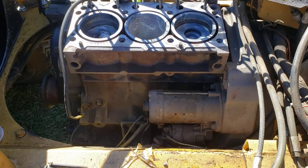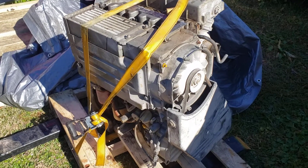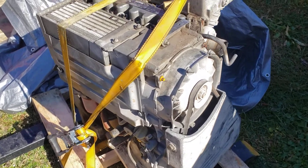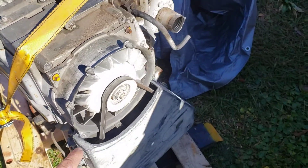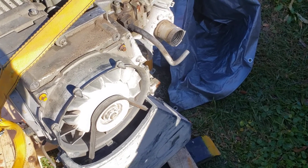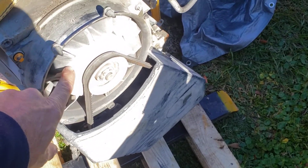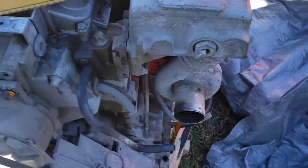Let me show you what we've got for the replacement — it is going to be awesome. There it is: the BF3L 2011, the newer model. The L means the cooler is already built onto the engine. The fan is already right here, so I will have to add a fan to my hydraulic cooler or change the cooler completely to something like what Carlton uses. The alternator is also built in behind here.